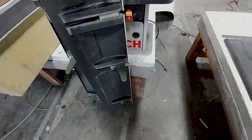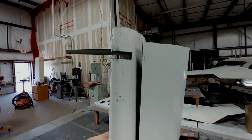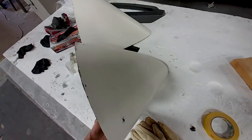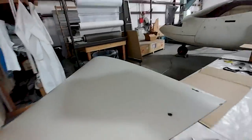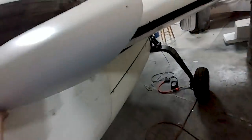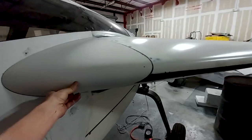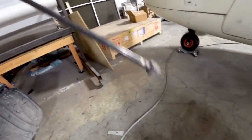Not too much more to do for the tail plane. There are the upper elevator skins with the slots. Here are the strake door extensions — now that they've all cured, you can see they were bonded together with a little hysol. This is going to be bonded onto the left-hand door just like that — when the door opens, it goes with the door and completes the whole look. I'm just holding it roughly there, not perfectly aligned, but it should look good when done.